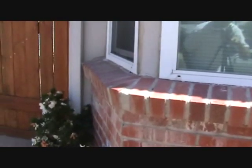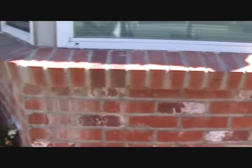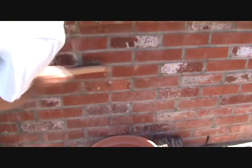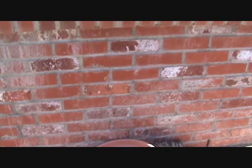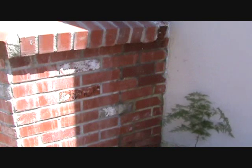On that top brick ledger, that's the only place where I saw the moss buildup growing, because it's on that ledge and comes off the windows and builds up on those edges. Down here if you see any little areas where you feel you need to do your metal brushing, you could do that first. It might clean up some of the stuff that the muriatic acid isn't going to get. But after you spray the muriatic acid on there, I would encourage you to use your metal brush and make this look really nice.